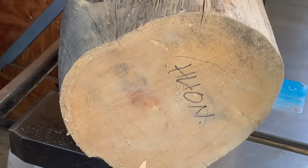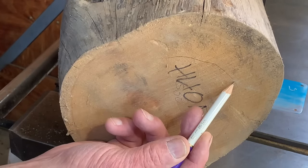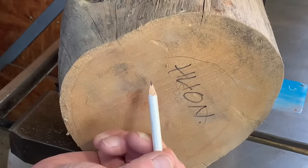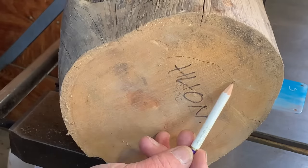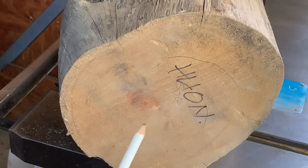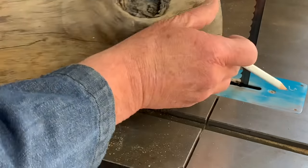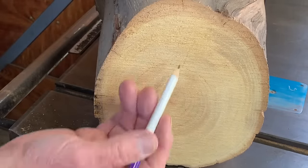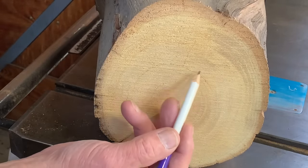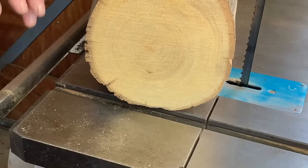So the first thing which jumps to my eye, and I hope to yours, is this little crack there. Now that goes round with the grain. It's what we call a cup shake, and if we're not lucky, it'll go all the way down through the log. Now I happen to know that we're not lucky because I've already cut a bit off this end.